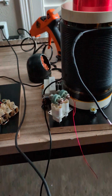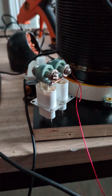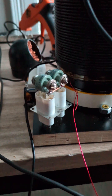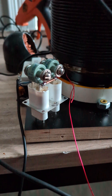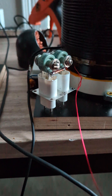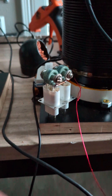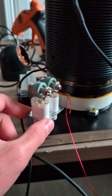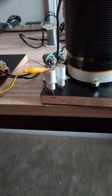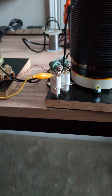This is looking pretty nice so far. Next up are the tank capacitors. The entire thing measures to about 700 picofarads. These two are a couple of 100 picofarad Soviet doorknob capacitors. These two are magnetron capacitors — together they measure up to about 500 picofarads. The entire thing is wired in parallel, and this will be going in parallel with the primary coil. Either way you're going to have to tune your circuit by adding or subtracting capacitors until you get the circuit perfectly in tune.